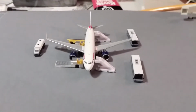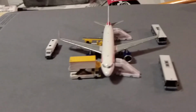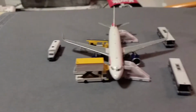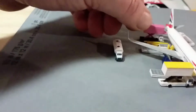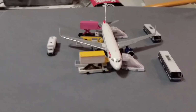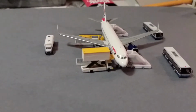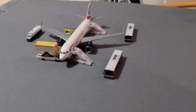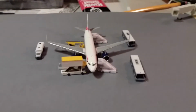Now I'm going to move on to the 737, which has not much difference, just a slight difference. Well, actually, wait, before I move on, catering truck. Can't forget catering. Catering again, one in the front. If you're putting one in the back, we have a stair truck there, so what happens in that case is catering is done before they put a stair truck there. Or the very rare case where we see catering go to the very back. That could be acceptable, although I never see this configuration. When it comes to small airplanes like this, all the catering tends to be done with one truck, and it will go into the front. And that's normally how it works. So this would be your setup for your Airbus aircraft if they're containerized. If they're not containerized, you just remove the two container loaders and replace them with belt loaders. No big deal there. Okay, now I'm going to show you the 737.